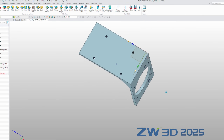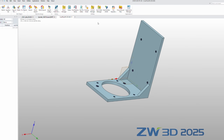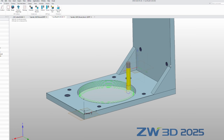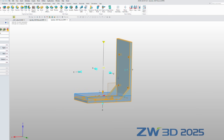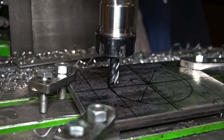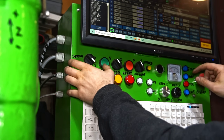Using the 3D CAM module, I prepared a toolpath for my CNC mill to do the motor flange bore. Here I switched from climb to conventional milling as I prefer it on my machine. Before verifying, I prepared the stock material and did the simulation. The toolpath looks okay and we are ready to go.